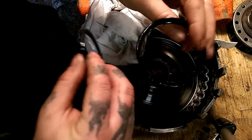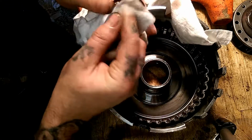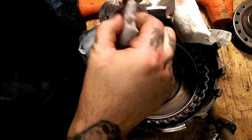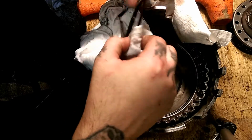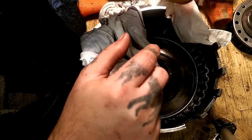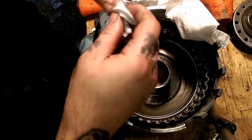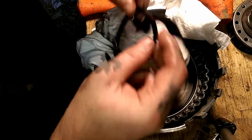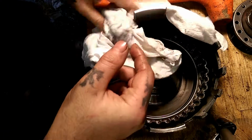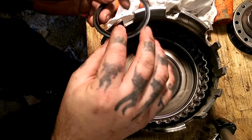They make a Trans-X and stuff like that, two different versions. They make a version that's just to help lube everything up and make your valves and stuff work better, or make some that can seal, make your seals flare out. That's what's been used in this one. The reason you've got to change all your seals is that it kind of just band-aids it. It helps renew them a little bit too, the hotter ones, but it's just a temporary fix. Sometimes it's a fix, sometimes it's not.